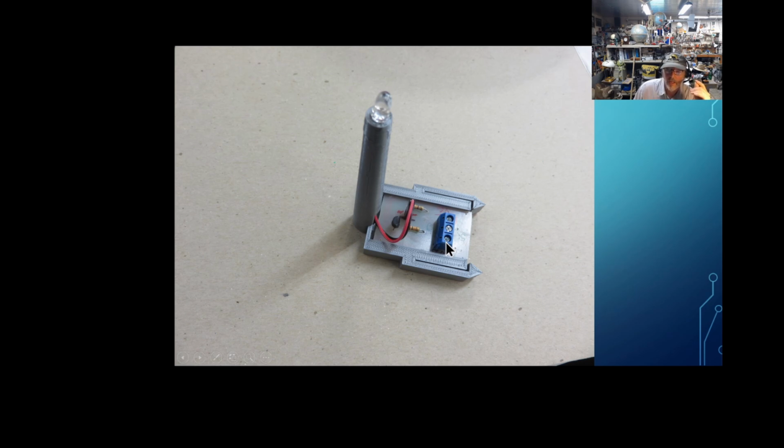LED driver that I'm hooking up to another aux line I have. And I've just got into Lua programming, written a couple small simple programs just to get prepared for this. But I think other people could use this too, because what this would do, as long as I've got an RTK lock, I want this LED light on. It's a really intense green LED light that I could see in full sunshine. And if I get a high coming from the aux line, that's representing the program.